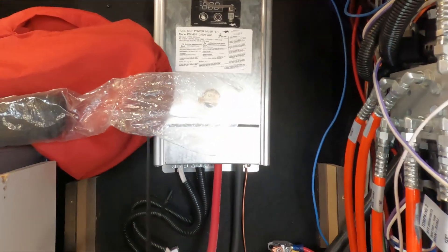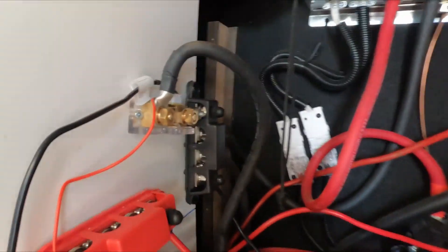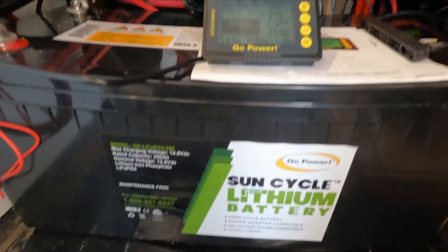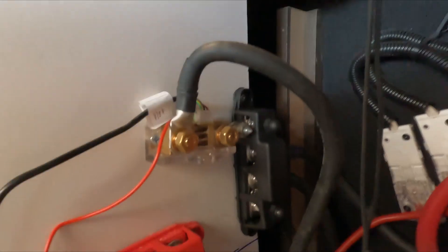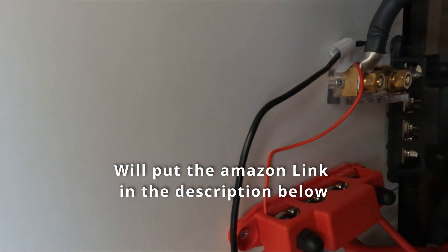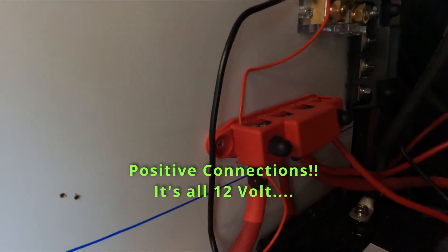Once I figured it out I decided to put two feeds on there just to be safe. This is my 2,000-watt inverter that comes down and goes through a fuse there. I went out and bought some good bus bars — real honest-to-goodness bus bars designed for this purpose. When we bought the Gold Power battery it came with a shunt already, so I connected that and did a hard connection. All my other connections were singled out and connected individually in the bus bar, covered with this nice connector from Amazon.